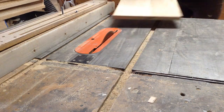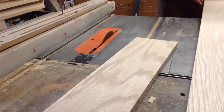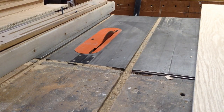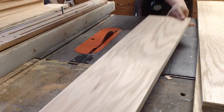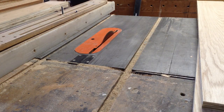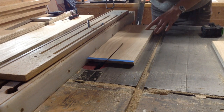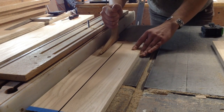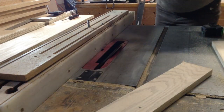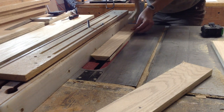For the top I'm doing a flat piece of ply across the top and then it's going to have some decorative elements around it. There are easier ways I could have done this, but I decided to use ply because it's going to be dimensionally stable and I didn't want the molding moving or gaps coming apart. Even though it is a facade, it's still a fairly large surface area, so I did want to put some structure into the piece.